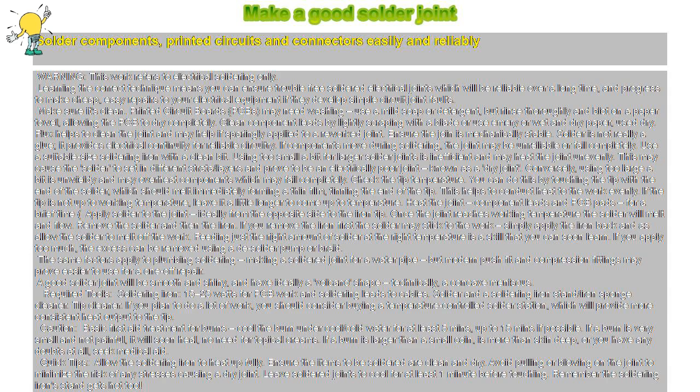Use a suitable size soldering iron with a clean bit. Using too small a bit for larger solder joints is inefficient and may heat the joint unevenly. This may cause the solder to set in different strata/layers and prove to be an electrically poor joint, known as a dry joint. Conversely, using too large a bit is unwieldy and may overheat components which may fail completely.